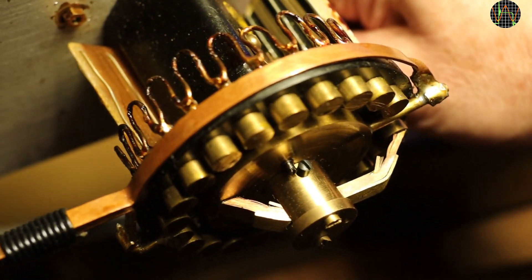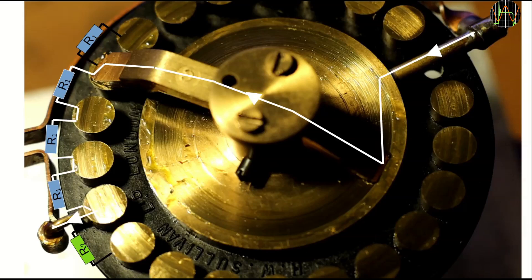These show clearly how these switches work. There are 10 blue resistors of value R1, each one connected between two neighboring small brass discs. With the knob in position 3, from the connection to the center disc on the upper right, through the pickup, over the turning knob axle and down to the arm, we have three identical resistors R1 in series before the current leaves the selector knob. At position 10 we have all 10 resistors in series, while at position 0 the current goes out directly with no resistor in between. The 0 position is shared between the upper and lower halves of the switch.